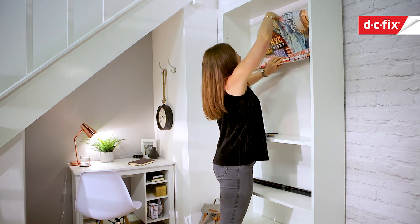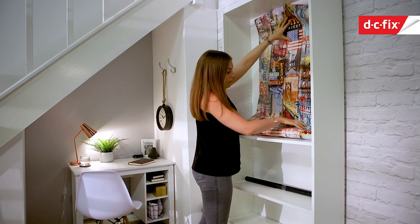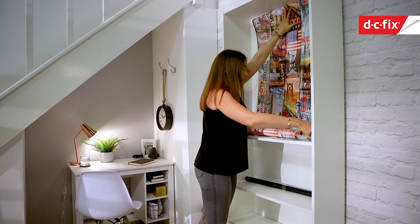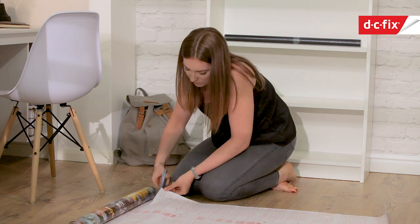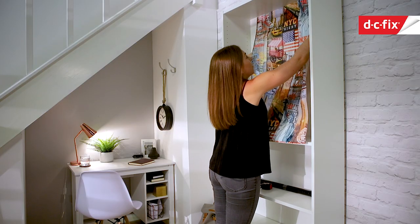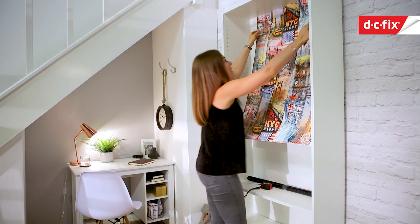I'm going to start in that top corner and just let it roll down with a little bit extra at the bottom. There are little grid lines on the back of the paper so I'm just going to use that as a guide to trim across. I'll pull that off and reposition it so it's right into the edge. Now we can start pulling this down — in the application kit you've got a smoother and a scalpel. The scalpel trims off the excess, and you use the smoother, felt side down, to squeeze out any air bubbles as you pull the backing paper away.